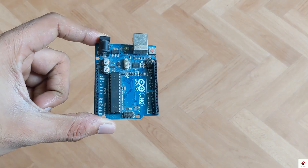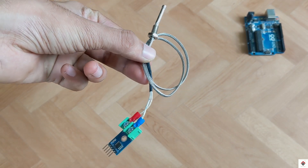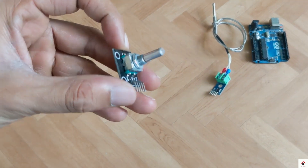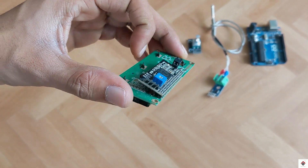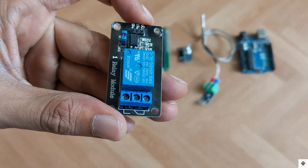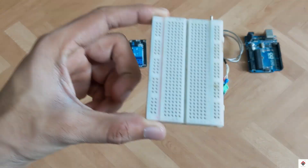Starting with the first version of the project, we need the following components. As a main controller I'll be using an Arduino UNO board — you can also go with Nano if you want to reduce the cost. To get continuous temperature as feedback I'll be using the K-type thermocouple with MAX6675. To set the required temperature we'll be using an encoder module. To display the set and measured temperature I'll be using an LCD module along with I2C interface. To switch on and off the AC supply we'll use a 5V relay module.